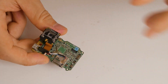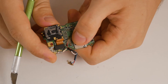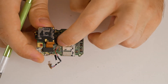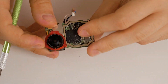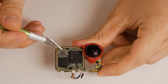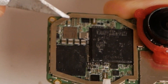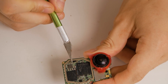Look at that gunk! Here we have the GoPro. I don't want to mess up too much with the glue here, but I'll show you a peek of where you can solder your 5 volt, because you need to solder your 5 volt somewhere if you have this broken. You can put a wire here — I first saw this from Kim Tang, who soldered a 5 volt wire here and made it pass through, and it just works. So if you break your connectors, this is a really good spot to put it.